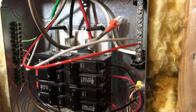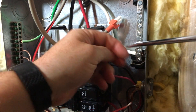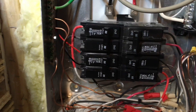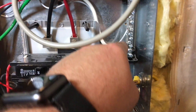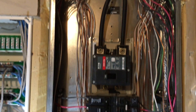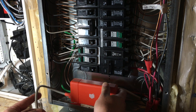Let's connect the neutral wire to the neutral bus bar. I just finished installing the wires into the breaker — I did that off camera because it was a tight fit for the tripod. I brought my other wire in and cleaned things up so everything fits. Let's go ahead and put the Sense monitor in, connect the antenna, and bring the CT cords up over the main lines. The monitor I'm going to have sit down here, with the wire dressed properly.